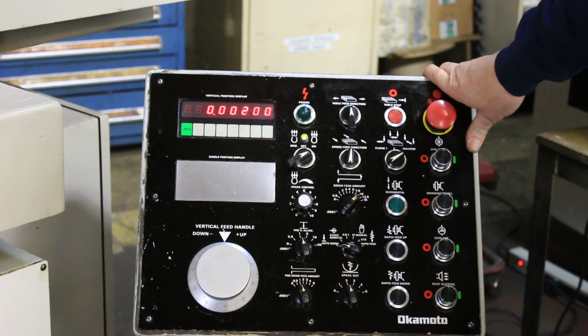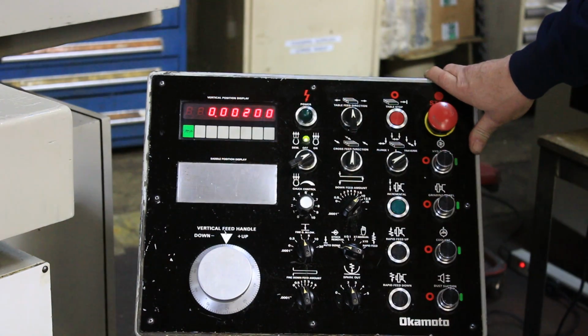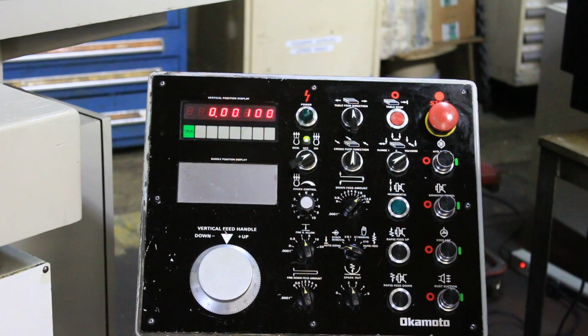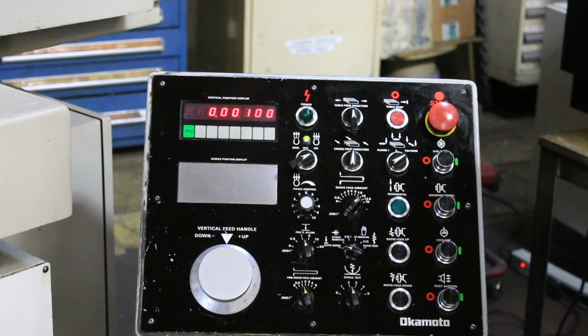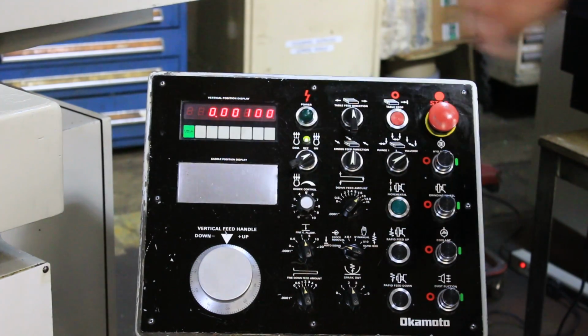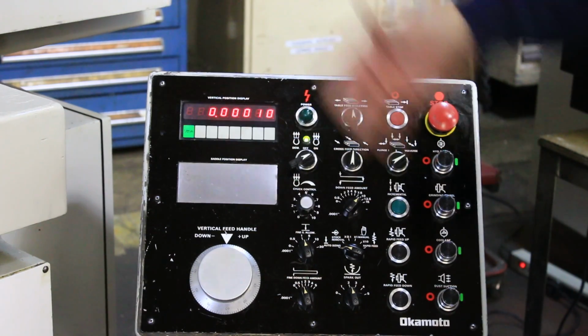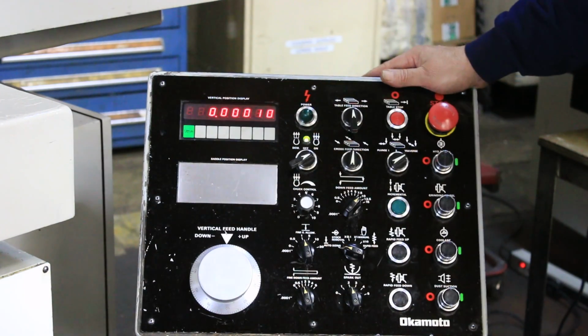the fine grinding allowance. It tells you where you shut it off. All right, we're going to run out of time on this video, but as you can see, it's feeding down now to the 1,000s. Now it's going to go into its fine feed, which will be in tenths until it gets down to 0. And then it will do a number of passes where the saddle goes completely back and forward and back again until the machine is completely sparked out. Okay, thank you very much.